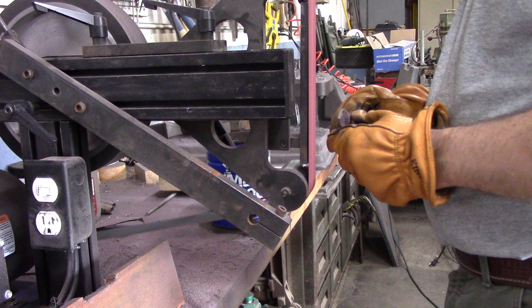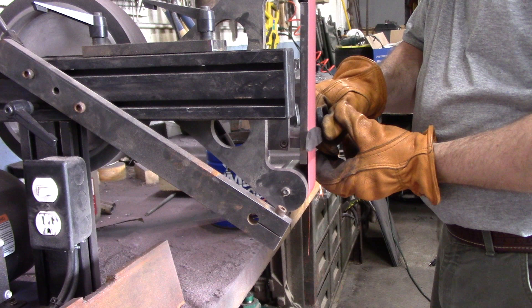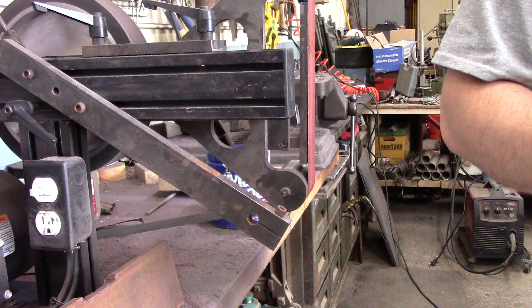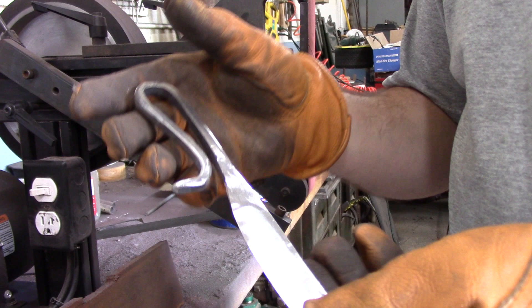That's going to be a little while of profiling and cleaning up the bevels, straightening them out — it's a little thick right now but not much — getting them pulled down all the way from the spine to the edge in a nice flat grind. You don't want to bring it entirely to an edge though; you want to leave a little bit of thickness on that edge so that it doesn't crack when you heat treat it. I took it to 120 grit before going ahead for the heat treat.